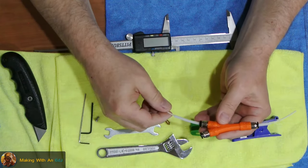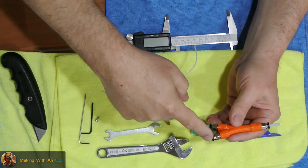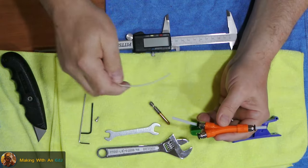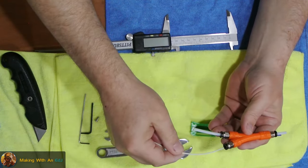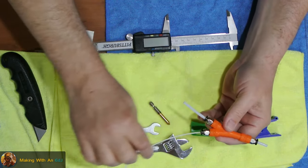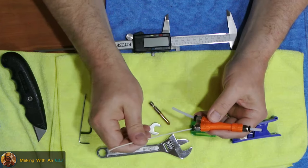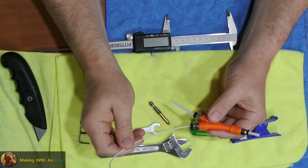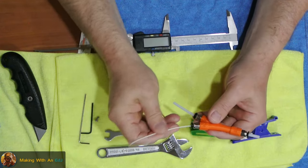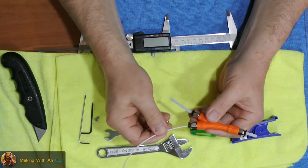You can test the top piece too — this is going to be the longer PTFE tube coming from the AMS, which loops around, goes in here, and then feeds the hot end extruder. The filament comes from the AMS, loops around, comes into this fitting, and if you slide it in and test it you can see there's no resistance. This is the more important one to have super smooth motion because it's fully automated — when the AMS retracts it pulls all the way out, and when it pushes a new color in it's got to hit the hole cleanly.